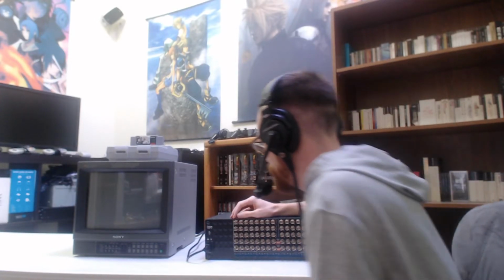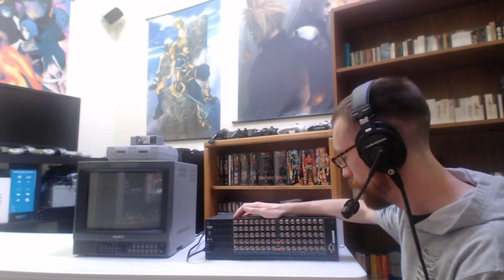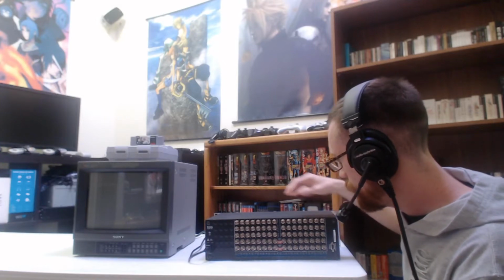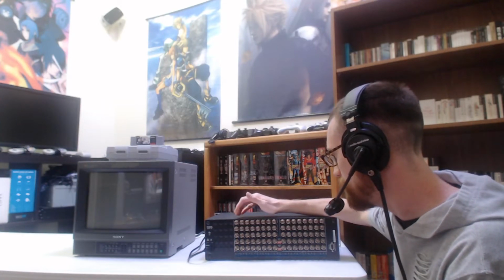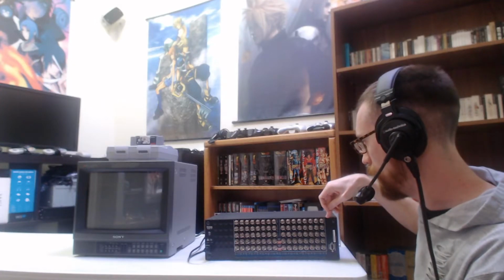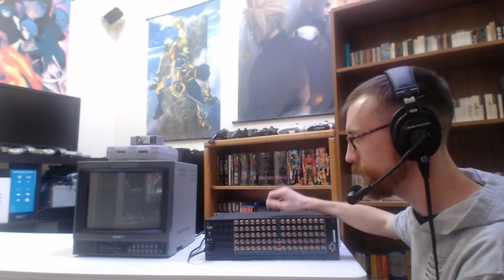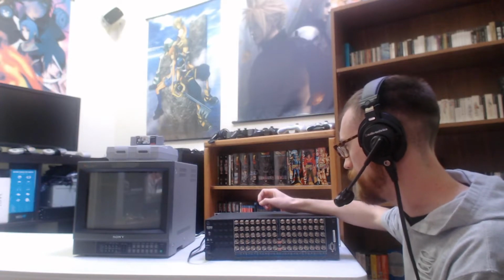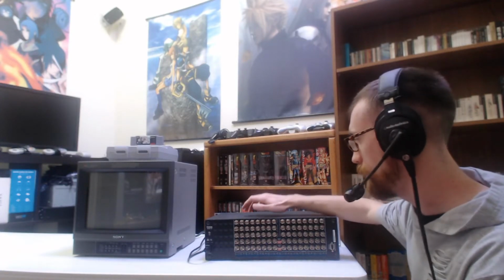And one thing that is interesting about these Extron Crosspoint matrix switchers is that you can run Composite, S-Video, Component, and RGB all out of them. If you want to use any type of input, whether it's Composite to RGB, it doesn't matter. You can only do 1-to-1. So whatever's in input 1, that has to be matched on any of the other outputs. So it has to be RGBS, Composite, Component, whatever. It's got to all match. So it's a 1-to-1 input output. So what you get in is what you put out. So that was one thing that I thought you might be able to mess around with, but you can't. So you have to do Composite in and Composite out, or Component in and Component out. That's all you have the option to do there.